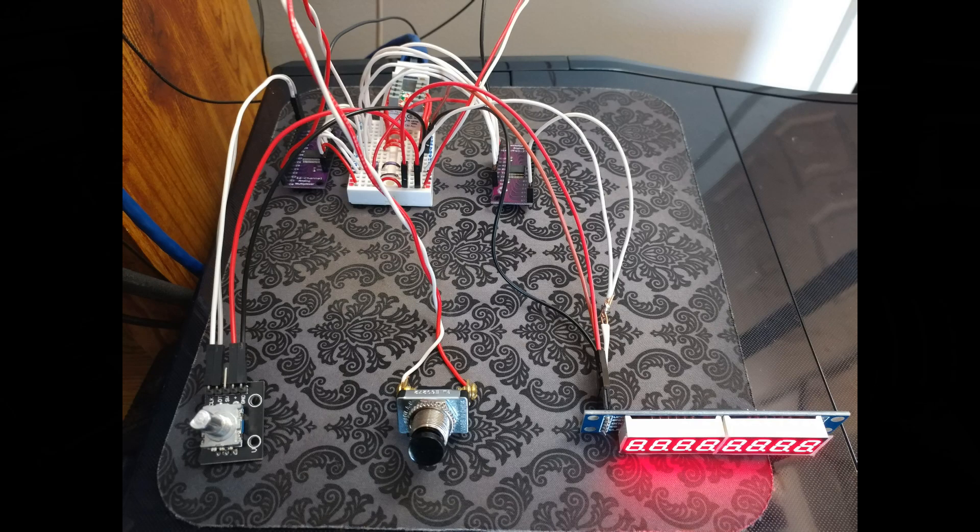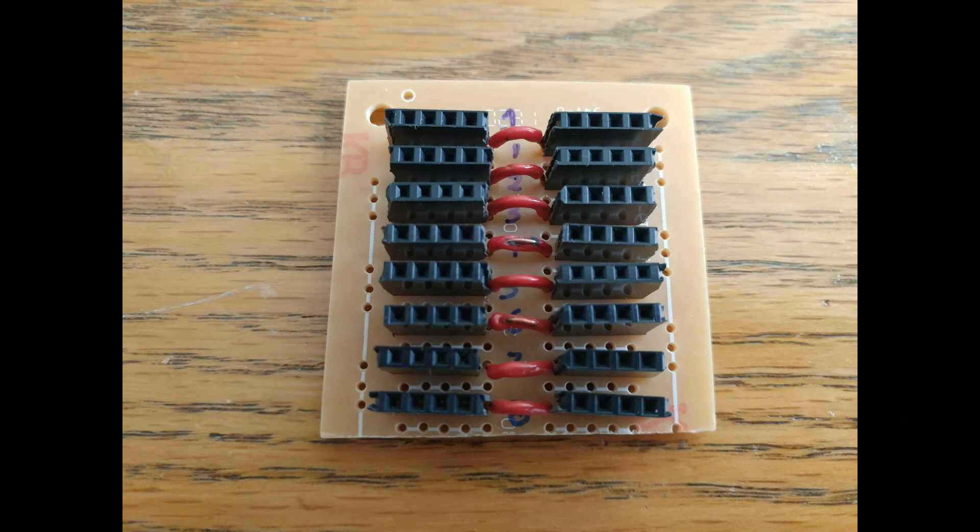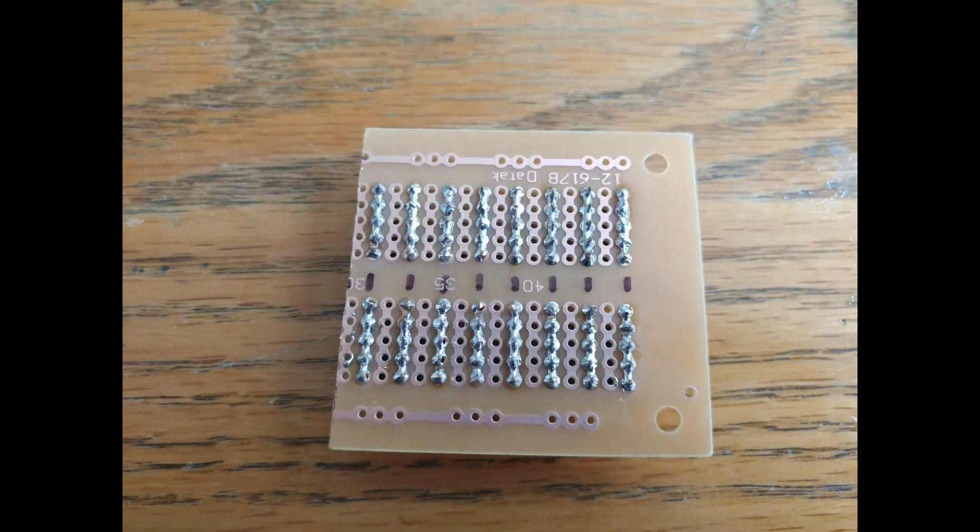I started noticing it was going to get pretty messy pretty quickly even this way. Right here I just set up a screen, a push button, and an encoder using two little multiplexer boards in my little distribution center, but I didn't like the way that was going. So I decided to make myself these little boards where each row is electrically linked together, so I can keep inserting signal wires from the different 16-channel multiplexers and join everything together, with only one set of wires going to the Arduino.